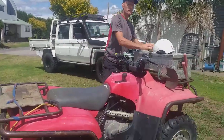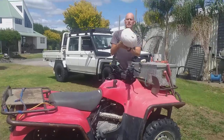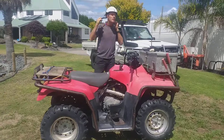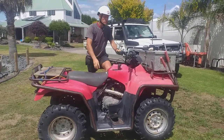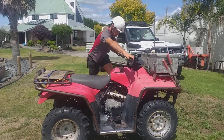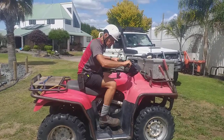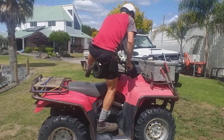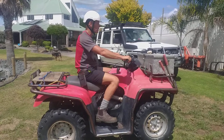The last thing to do is to check the cables and controls. We're ready to get on this machine now and set up our personal protective equipment. One of the most important things is your helmet. When you come onto the bike, mount from this side — three points of contact. Swing your leg over this way onto the machine. If your foot jams down onto something on this side, it's only the brake. If you swing from the other side and crash down, you could break the gear lever off — they're pretty fragile, so be gentle with them.